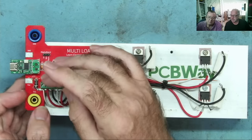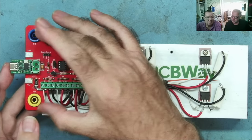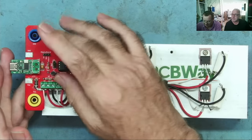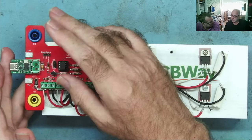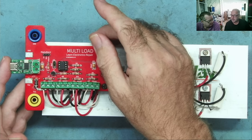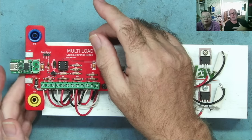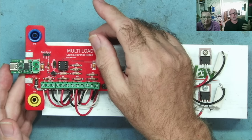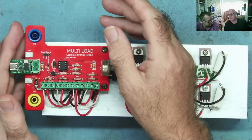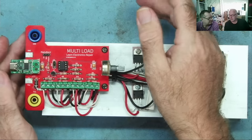The second one, the daughter board is monitoring two things, the input voltage, and the current, which is the voltage across this resistor. Now, what's the processor on the daughter board going to be running at? 3.3? Yeah, when we were talking about the voltage regulator for the daughter board, we decided to go for 3.3 because this is below 5 volts. So if you have a normal USB supply, you go for 5 volts and our regulator will go down to 3.3. Yeah, so it has some headroom. Everything electronic on the daughter will be 3.3. So even on a 5 volt supply, we can get a nice steady 3.3.